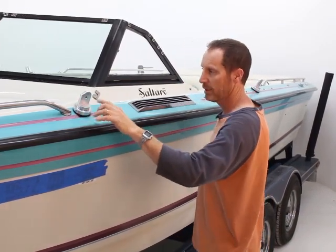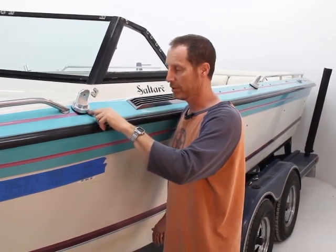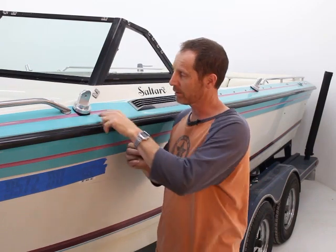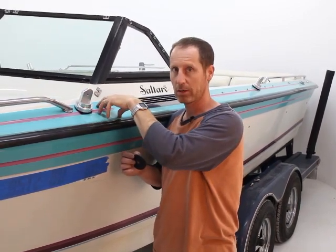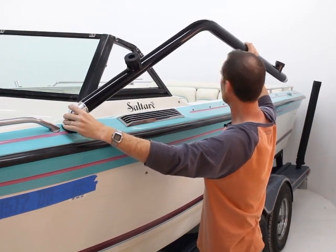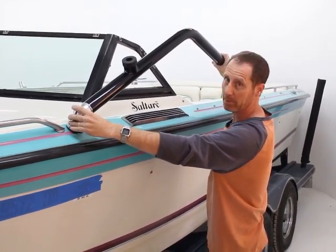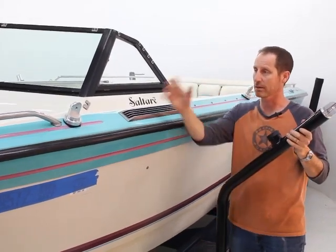I know where this is and I have 66 inches. This boat actually has a slight negative radius, and it's very thick fiberglass. We went ahead and drilled through, and we used a flat gasket here — you get extra gaskets, some concave and some flat with the bigger towers. We cut a little piece of the radius gasket and put it in there; when we crank it down to compress it, we'll trim the excess with a razor blade. The next step was deciding where the back mount goes. I installed the front mount first, bolted it in, and let the back mount be the guide — someone came back and sketched a mark on the boat, and then I knew where to install the back mount.